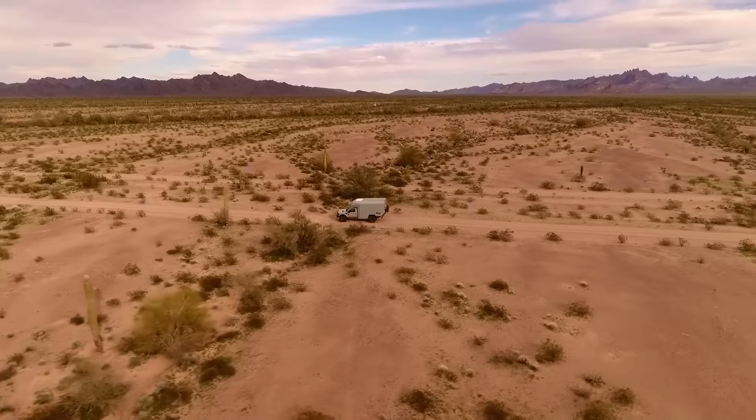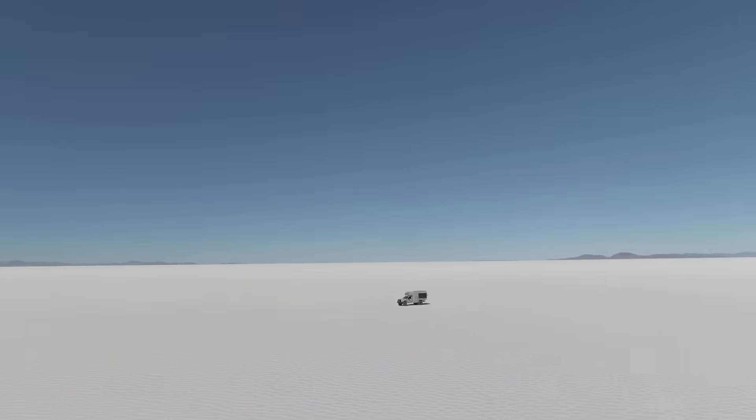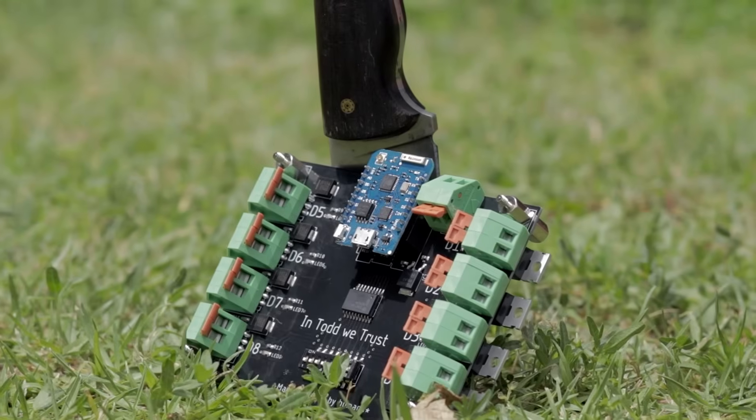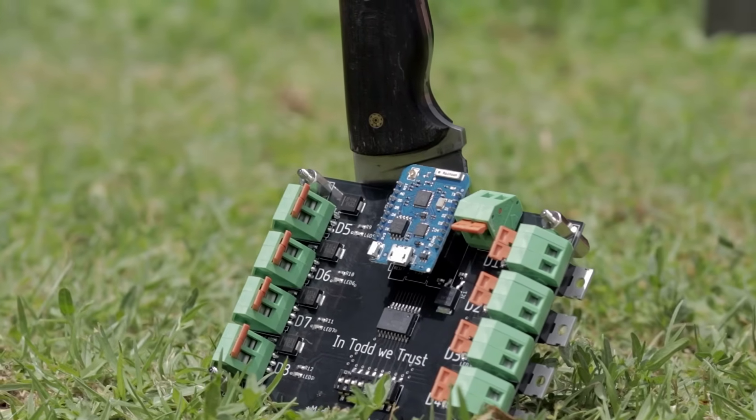Half a decade and 15 countries later, I have to admit defeat. They're not ideal, because in an RV or automotive environment, most systems are negatively grounded and then switched positive — so that's what I built. Unfortunately, that design choice makes my controllers fundamentally flawed for dimming LEDs. Thanks to the p-channel MOSFETs that I used, they have a somewhat high on-resistance, combined with a limited PWM frequency of an 8266, and the result is a lighting experience best described as functional. The brightness levels stutter, transitions are anything but smooth, and the lowest brightness setting is still too bright.